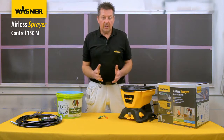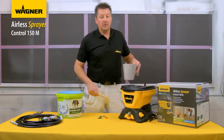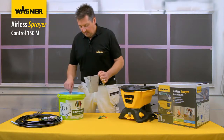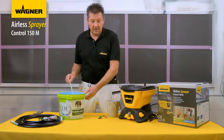To dilute and get the correct consistency of paint, add 10% water and increase by 5% at a time as required. Mix the paint well, then lift the stirrer from the paint and observe how it flows — it should run smoothly and continuously and dissolve into the paint without leaving a trail on the surface. Getting the paint consistency right will ensure you get a professional finish.